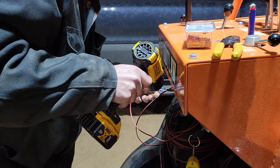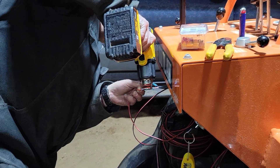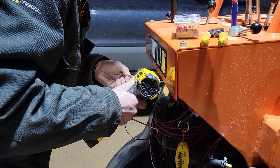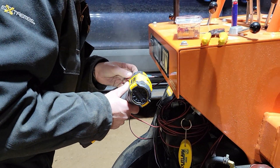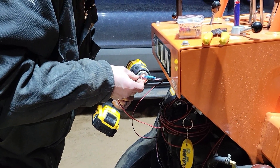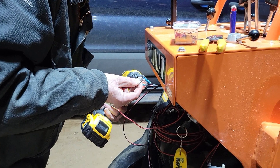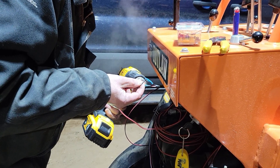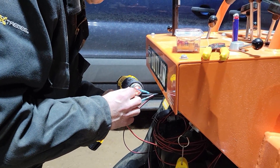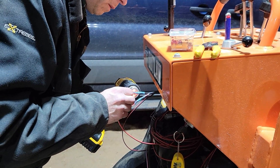Most of these little units seem to go about three miles an hour. But because this is a four-speed — it's got a normal with a high and a low, and then an overdrive — you can really manipulate the speed and fly. The downside with the overdrive is it does lock the unit up in the front and puts all the hydraulics to the wheels, so if you pick something up and kick it into overdrive, that object stays locked and you just drive with it. But when you're going between buildings — my far buildings are about a quarter mile away — it's nice to have that extra speed.